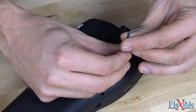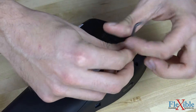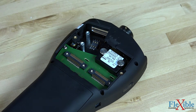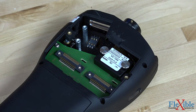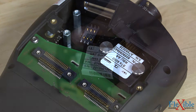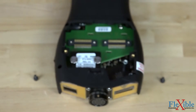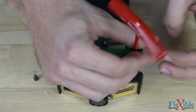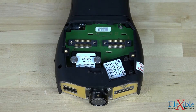The modular design makes upgrading and expanding the functions of the ST Analyzer easy with the use of Atlas Copco RBUs. These rapid backup units are the same as those used in the ST wrench platform and act as a backup for programming and configuration. A variety of RBUs are available for a wide spectrum of applications and add additional features such as real-time statistics, residual torque detection, and angle monitoring.